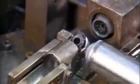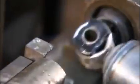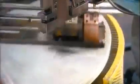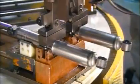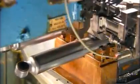Now they press a bushing into each mount, which helps tone down the vibrations coming from the vehicle. Next, on an automated carousel, robots pierce a hole in each shock and inject nitrogen gas to prevent the oil inside from foaming. After injection, the robot seals the hole by welding on a tiny steel ball.